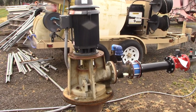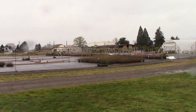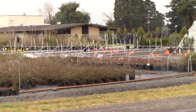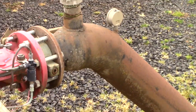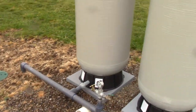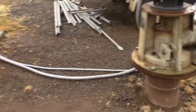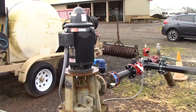Now let's say someone taking care of crops in the field wants to turn on the irrigation — for example, across the street here we see this can yard with irrigation heads. Someone turns on the irrigation to irrigate the pots in the can yard. Water is going to start leaving the pipe, coming out of the pressure tank, and going out into the field. As water leaves the pressure tank, the controller senses that drop in pressure and tells the pump to pull up more water out of the ground.